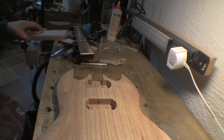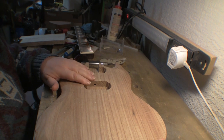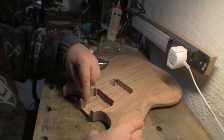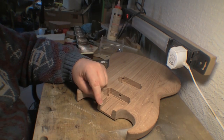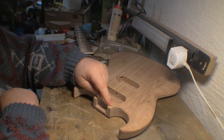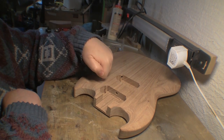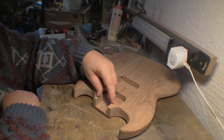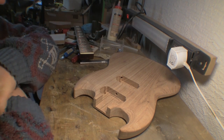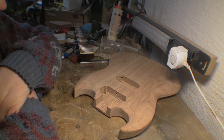Here's the glue-in body blank. As you can see, it's a flat slab cut out — it's got the pickup and cavity routes already done, which is no big deal since I have templates for all of that anyway. However, the challenge is up at this end. This whole arrangement here is very different from what I need, so this will be the first test. What I'm going to try to do is find a way to fit the neck into this pocket and have it reasonably secure, because anybody who knows this particular design will know that its Achilles heel is the neck-body joint. Seeing if I can get that to be rigid from a resonance point of view is going to be test number one.